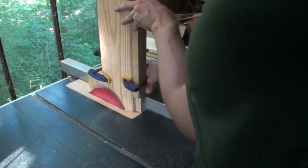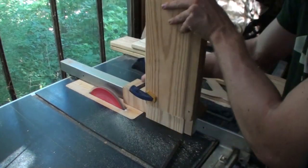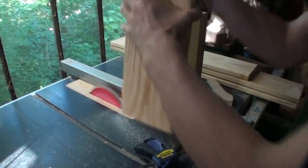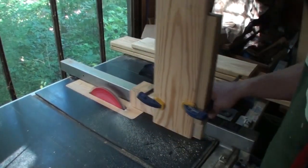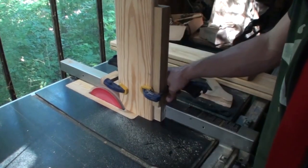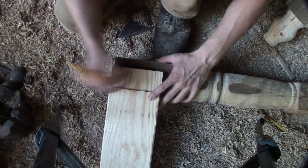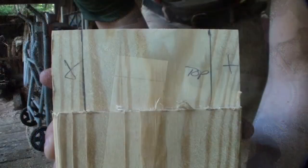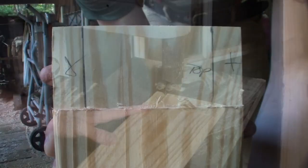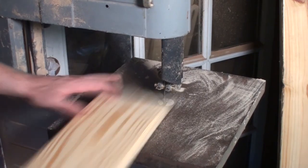They are three-quarter inch tenons to match the three-quarter inch mortising bit. With these being one-inch boards I'm just cutting a quarter inch off of them using a dado blade — it's just one pass and it's done. Then you just flip it around to cut the opposing tenon on the end of the board. It really is a pretty simple technique and produces fast, accurate tenons. I did the layout of the tenons and then used a band saw to cut off the excess.